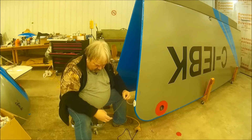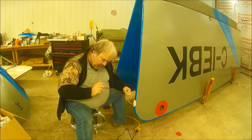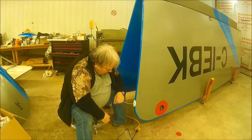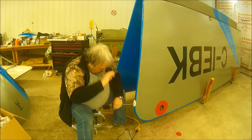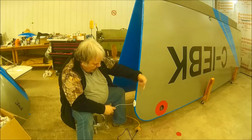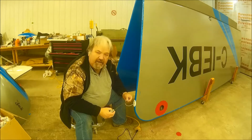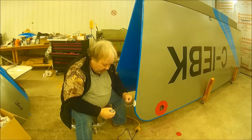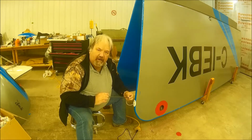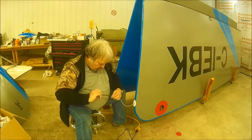And I cut it long enough so that it goes right to the very strobe itself. The reason for that is because I can't deburr the tube on the inside of the tube, and I can't deburr it on the back side of the tube. This heat shrink tubing is very thick, and it has that heat activated glue inside of it. And I want it to the very end to give it an extra layer of abrasion protection. So, yeah. That's what we're going to go with.